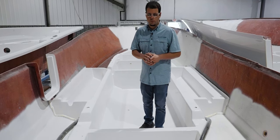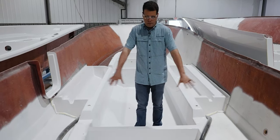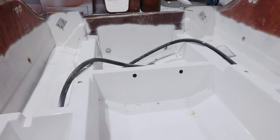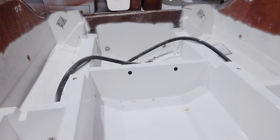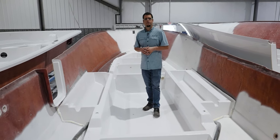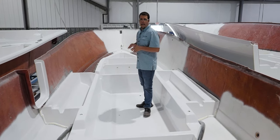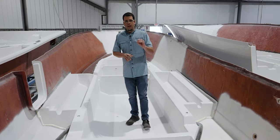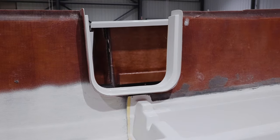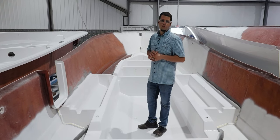For example, the back area is the bilge cavity — notice how it's completely gel-coated over, making it easy to clean and nice to see when you open your bilge. In front of that is a cavity that will become the fuel tank cavity. Forward of that, we have additional storage as well as space for the anchor rode. A very important feature built into our stringers is support for our side entry doors — notice the additional knee that provides necessary support. We also have built-in in-floor boxes.